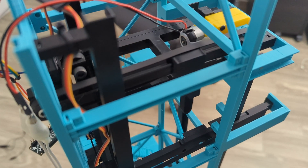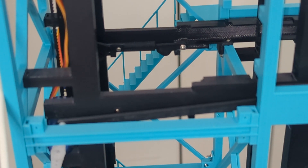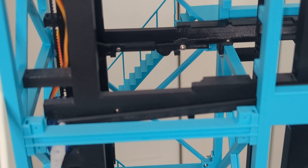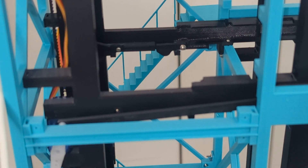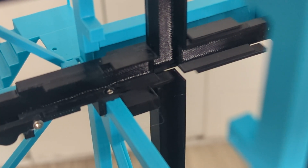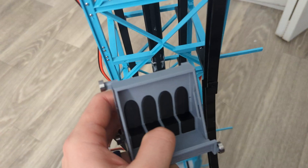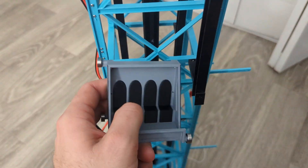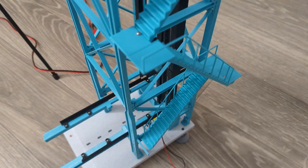Finally, let's talk about the drop. The trap door sits along the outer portion of the rails with clamps for it to slide in and out of the track. One end is connected to a linkage that extends to the back of the tower, where a pair of servo motors sit behind the lift track. When the ride calls for a drop, the servos rotate, which pulls the linkage and therefore the trap door. Currently this is the only mechanism that is partially automated with a microcontroller. The system has worked perfectly so far, and it's super satisfying to drop the cabins — at least partially, since I don't have the rest of the ride built yet, so dropping them will either break the cabins, break some of the track, or both.